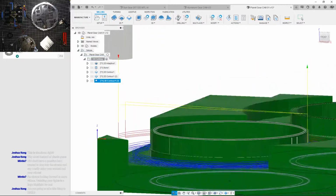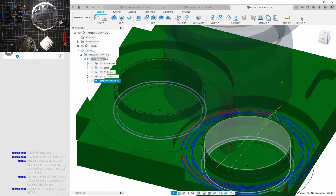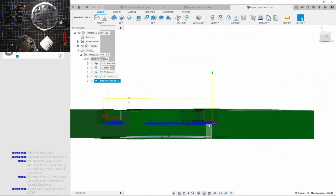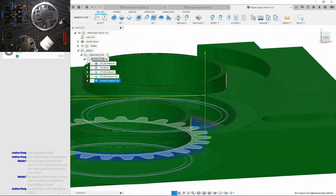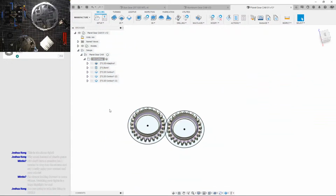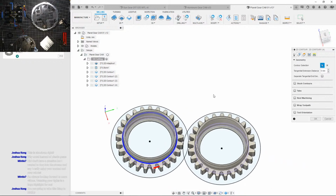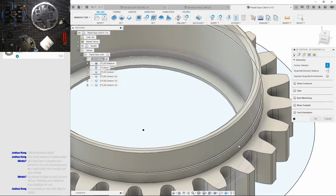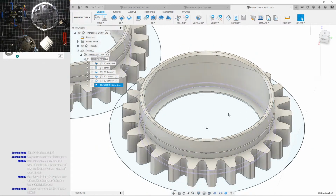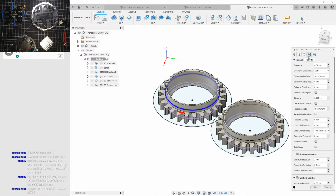Okay, yeah, I'm hoping this will be where... It's been a while since I've done this type of toolpath where I'm doing contours around it. And I only have a 1/4 inch end mill, so we'll see. Let's change it to the other side. Oh yeah, let me make sure I'm leaving some stock.